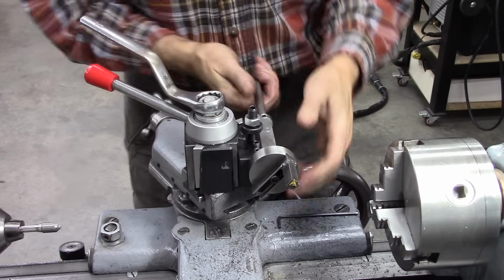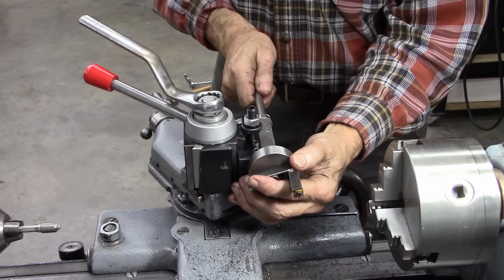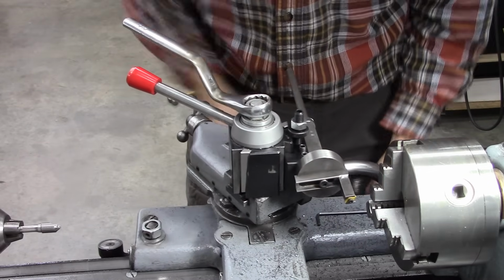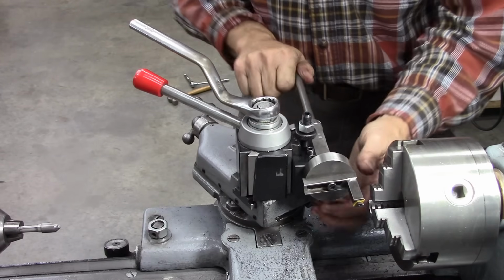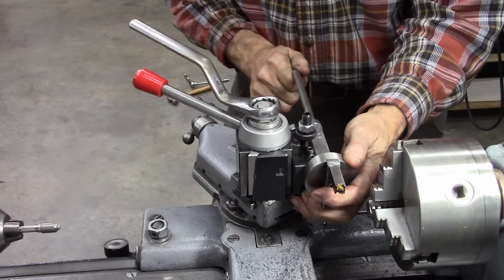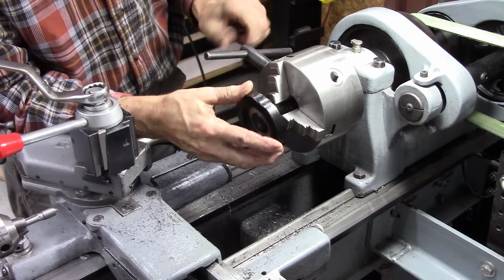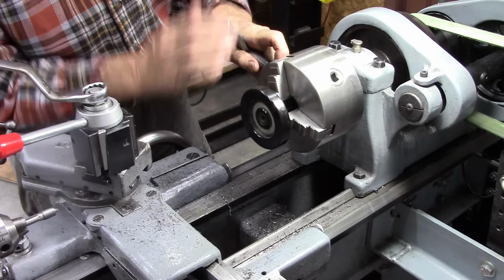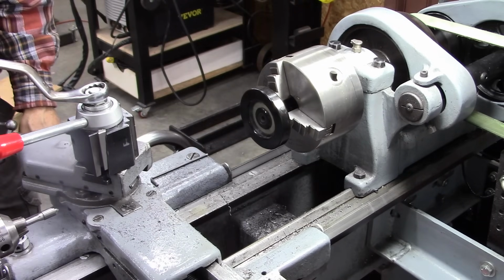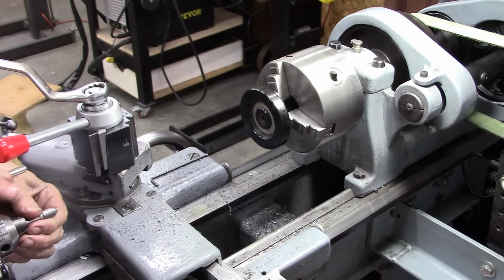Okay, I think this is going to work good. Thing is, I've got to come up with a handle on the end and get it oriented right. Shouldn't be a problem though. Straight down from there. Found an old hand wheel here, surplus hand wheel, and I think that'll be good enough. I'll just ream that out to 3/8 of an inch and put a little flat spot on that shaft probably where it'll grab it. I think it'll be good.